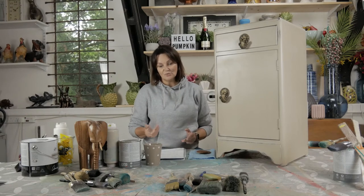So the first stage is to prep. I do have a blog post on this on my website and there's a link below. But quickly, you would clean it. I clean it with TSP and a mixture of water, but you can use water, some people use vinegar, some people use a tiny bit of bleach, but obviously wear gloves. And then you would key it, so give it a light sanding. I tend to use 180 to 200 grit, and then obviously wipe off the dust residue. And if it's still damp, just let it dry.